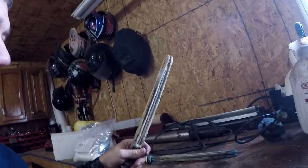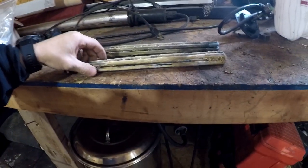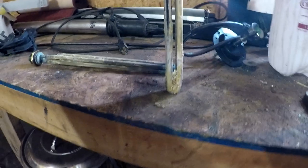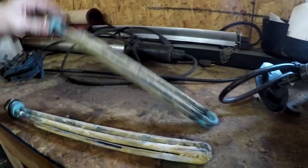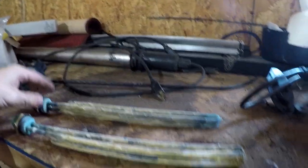It does take some effort on your part, but other than a little bit of effort and time it's basically free. Take the heating elements out so you can see all the lime scale on them. Ours has three heating elements. These first two get dirty — number one especially gets a lot of buildup, number two gets a little bit, but number three is rarely ever used because we don't require temperatures high enough to need all three elements.